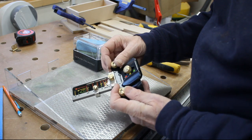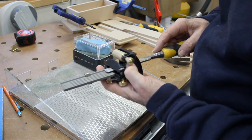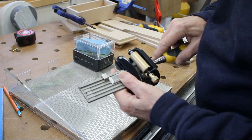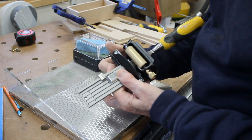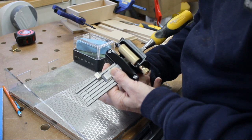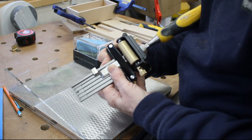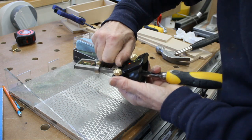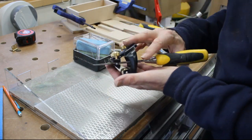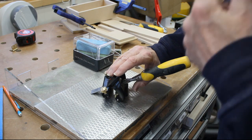You slacken off the two side nuts and then put the chisel blade through until it reaches the stop you've set, then tighten up the knurled nuts. That should leave the blade in exactly the right place to get the 25-degree angle. You then undo the guide piece, slide it off, and now the roller will set you at 25 degrees.